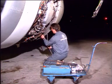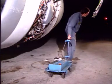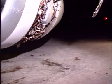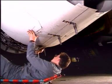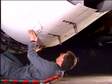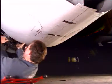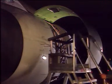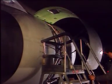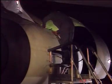When the door is fully closed, disconnect the hand pump from the hydraulic manifold and replace the cap on the quick disconnect. Complete door closing by securing the latches. Engage and lock the 4 tension latches. Remove the inhibition pin from the hydraulic control unit lever to put the thrust reverser system back to the operational condition.